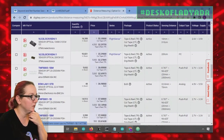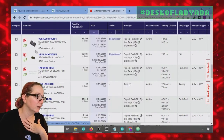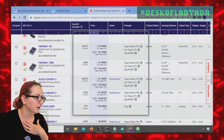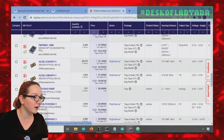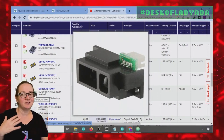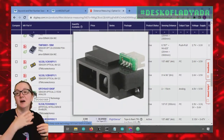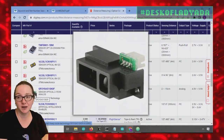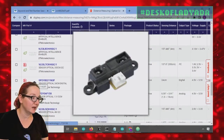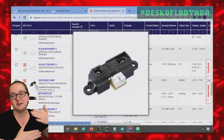That familiar GP2Y family also appears here under distance. So there's proximity and there's distance. Technically the distance sensor category should be sensors that give you literal distance — like ultrasonic, time of flight, or calibrated infrared. But it's mixed up because the category is old enough that it probably started with the GP2Y series chips, and then digital sensors got mixed in with it.